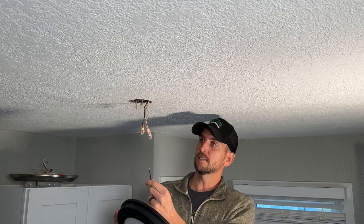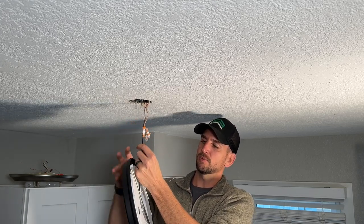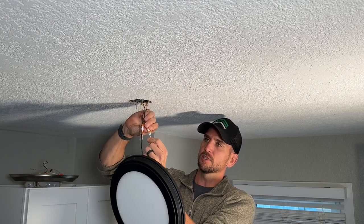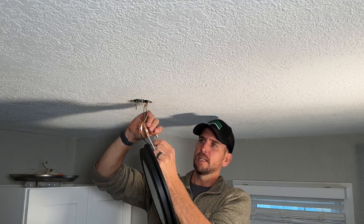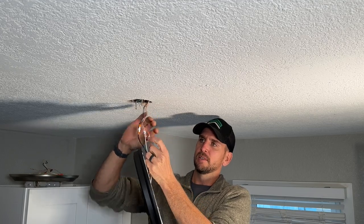Here's a real example connecting an integrated LED light fixture. It literally takes about 18 seconds to connect the hot, neutral, and ground — you're just flipping the levers and the connectors are already in place. With wire nuts, it's so common for DIYers to make a bad connection, especially with vanity lights and ceiling lights where you're up in the air and also holding the fixture.